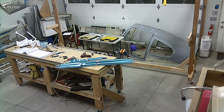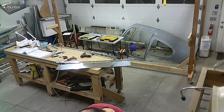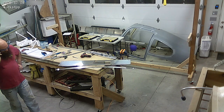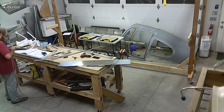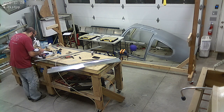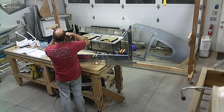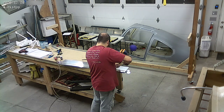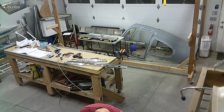And then if there's any other things that have to happen — if they have to be dimpled or anything like that, and these parts did not need to be dimpled — you do that, and then you get them ready for priming, and then you prime them. In this case, because I know I want to do one shot of priming and there was going to be a warm day, I believe it was Thursday, I want to get all of the parts for the bulkheads done. So this is, I believe, the third bulkhead front to back. And so I'm doing the same thing, and here is the fourth.